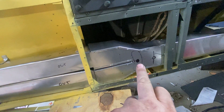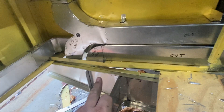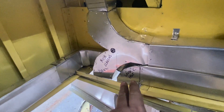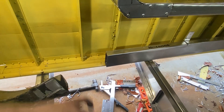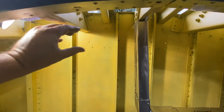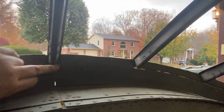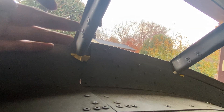Here we are again — this comes from the heat transfer system within the wings, and you've got this junction here which I'll go back to. Then two go off: one goes directly into the lower compartment underneath the flight deck, another goes to the lower area, and this one goes up over here. Then this one in the back is actually a T — it goes around here, comes out here and goes this way, and it's for the diffuser at the aircraft commander's feet in the console. This one goes up here — I haven't finished this yet — but it's going to tee off on both ends and then goes into the canopy frame which is hollow.